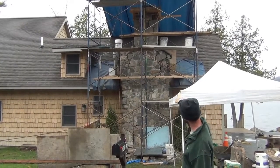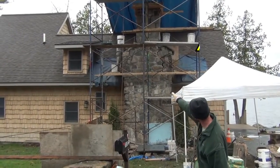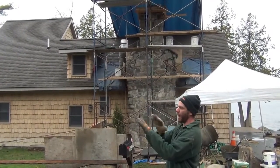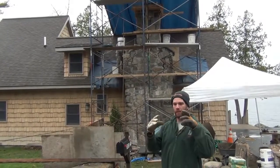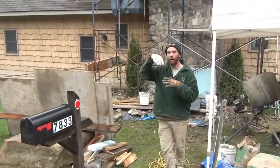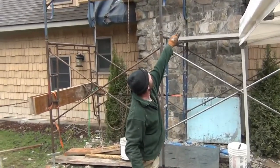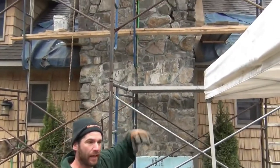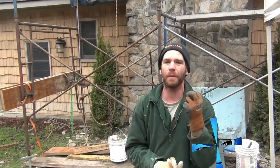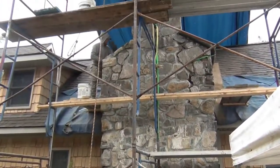The other way that water got in and destroyed was the shoulders on the fireplace. We just put a new stone on one side and we're going to put one on this side. The masons before us had just laid stone on that angle. It never works because the stones expand and contract differently from the mortar, and water works its way into those cracks. You can see the water has just eaten away. As it breaks in there and freezes and thaws, it's just breaking down the mortar — both those wing walls were broken. So we've pulled those down to repoint them.